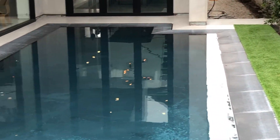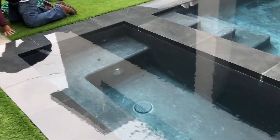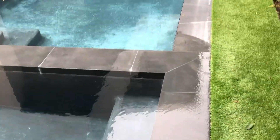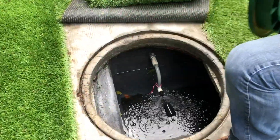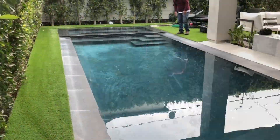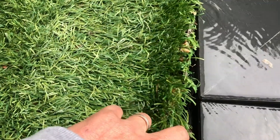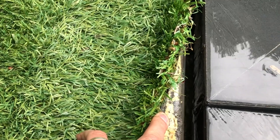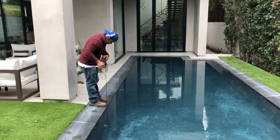Here we have a complete slot drain around the pool with a separate tank over here. We're going to dig into that in a little bit. We'll pop the head off the tank — in these surge tanks they usually have autofills, sometimes chem feeders, sometimes filters. We're going to treat this pool like a regular pool when it comes to the actual leak detection. We'll do a visual inspection, as we always do, before we break out any listening equipment.